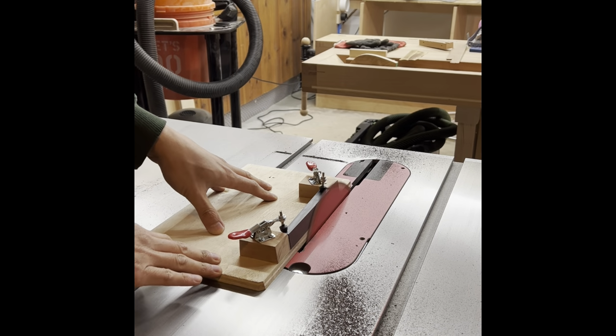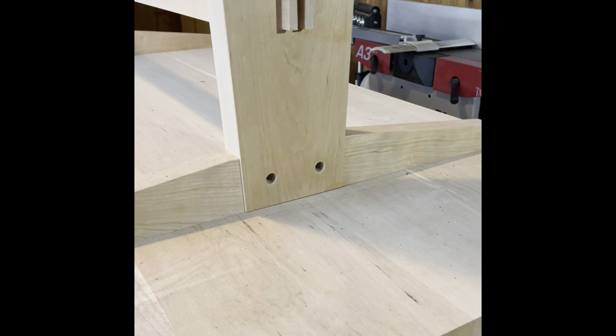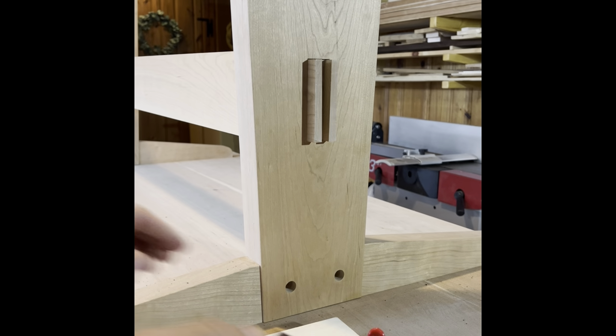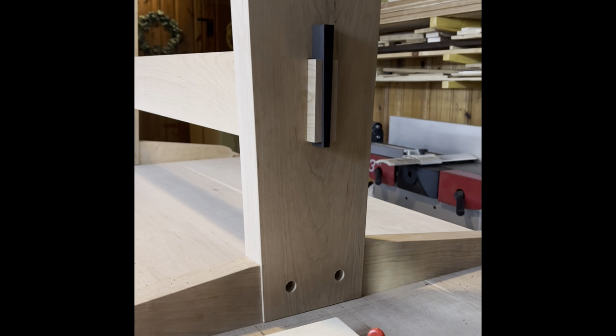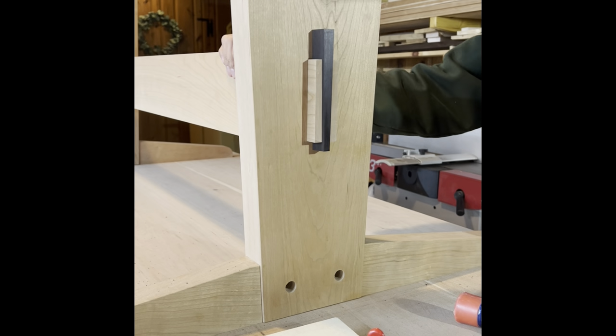We start conservatively from the line and expect the part to be too large. After a while, your eyes get good at estimating how much needs to be shaved off, but a surefire way to nail this fit is to attach blocking against the wedge while it's on the sled right before you make the cut. If you need to return and remove more off on either end, you can insert tape or spacers to pack out the part of the wedge and thereby be able to take micro shavings off the wedge where needed. But this is the exact fit we're looking for.